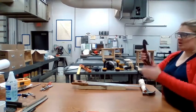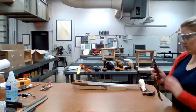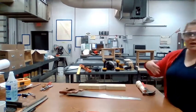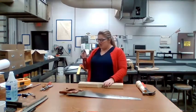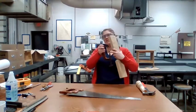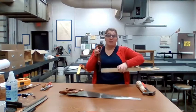They're all hanging up in there, but you just put this on your board, underneath the table or whatever it may be, twist, and it'll tighten into the table. One thing you need to be very careful about, especially because we use them with metal, is that sometimes they are dirty. So if you're putting it on your nice pine board or whatever, your nice clean board, you might need to wipe them down a little bit. The other thing to be careful of is when you put this on here and you start cranking on to tighten this down, well, if it's one that's got a ball like this, it's going to put a divot, a dent in your board. If you are cranking down super tight, it may divot on the top as well.